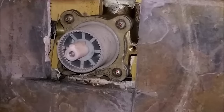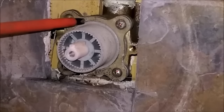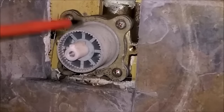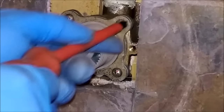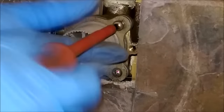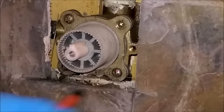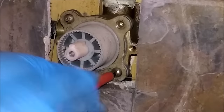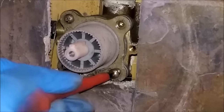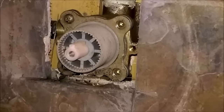What you're going to have is these four screws. You're going to take those out — one is kind of hidden under here. Then there's a metal bracket that's going to come off, and then hopefully this thing pops out without too much trouble. Make sure you do not lose those screws — that would be a huge pain. If you're worried about them going down the drain, make sure to cover it. It helps to have a magnetic-tip screwdriver.